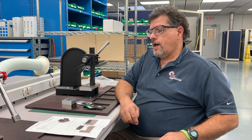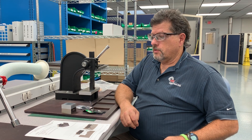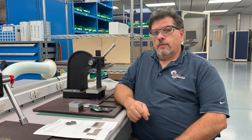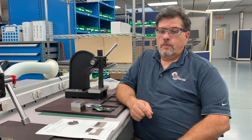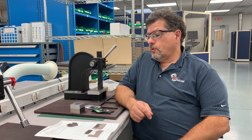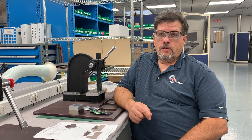We're going to do an assembly for a V-TAC right angle insertion using the PCB assembly instructions. The part number we're going to insert is the 610-151-104, and we're going to use the tool, which is the 910-112-132.